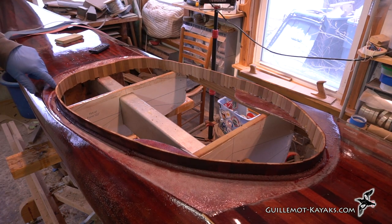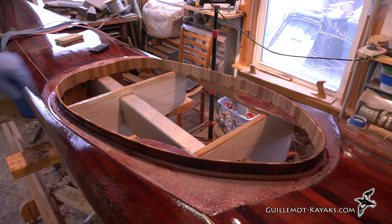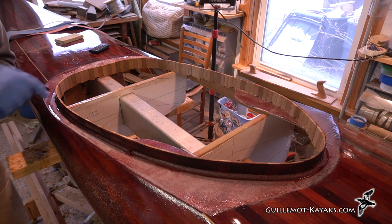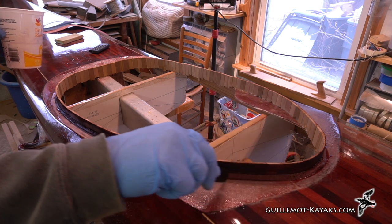down into the corner of the recess here, because if you remember, I glued this together with CA glue before staining it, so the CA glue acted as a resist and made it so that the stain did not color that part of the wood. So I've got a bright stripe there, so I'm just going to bury that under a little bit of the fillet here. It'll be really thin. See how that works out.